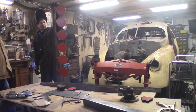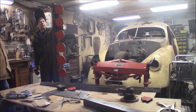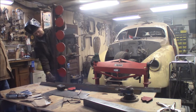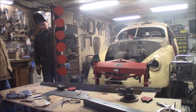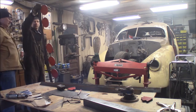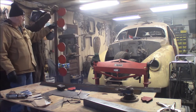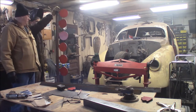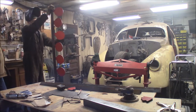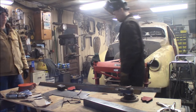That's a secret to welding: don't weld all in one shot because you get a little warp. But for what we're doing it doesn't really matter. You don't want to put the heat right to it. So we're going to cut this off down here, lower this thing down, and make a base. It leans forward about 10 to 12 degrees so things flip and stay flipped.